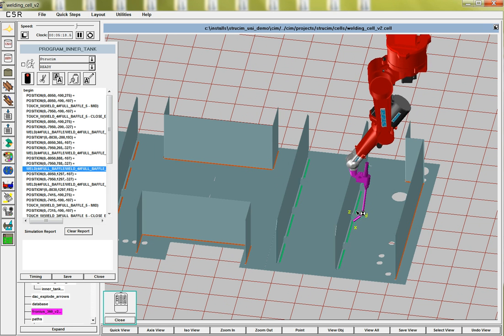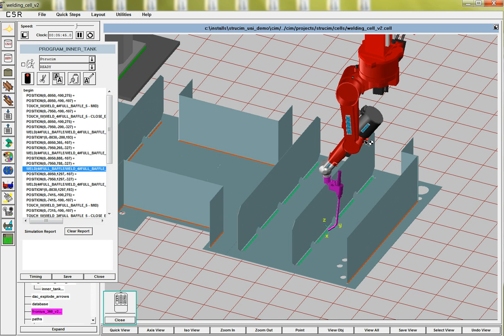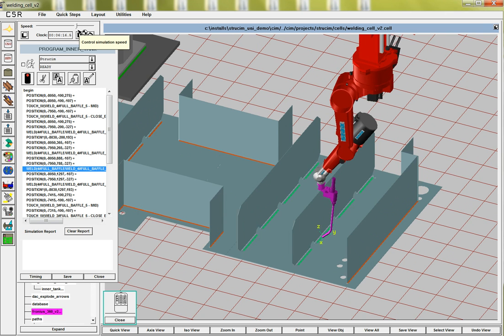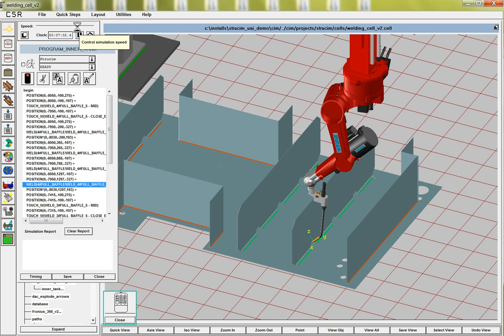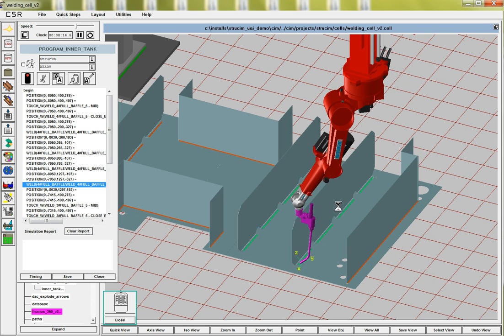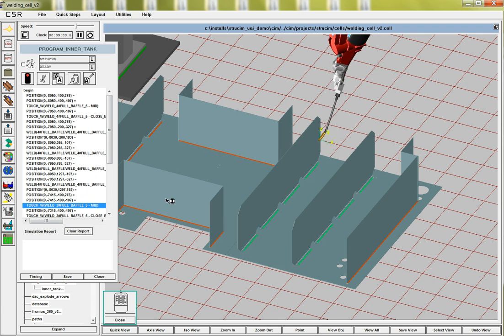Yeah, see, we didn't jump up there. I think it's just because we did that first one and we did that vertical lift and we took it out of these. And then this last one we run out of Y distance. You can see it. See how the Y stopped, but the robot's now moving. So we could have potential problems with that guy. It's kind of stretching the robot. We might think about positioning this differently.